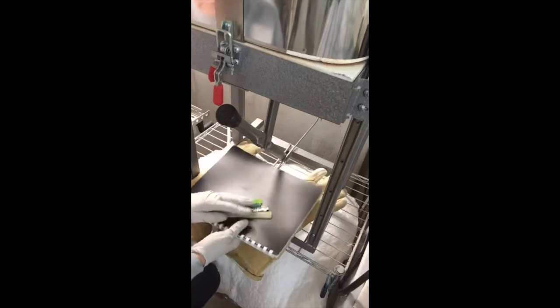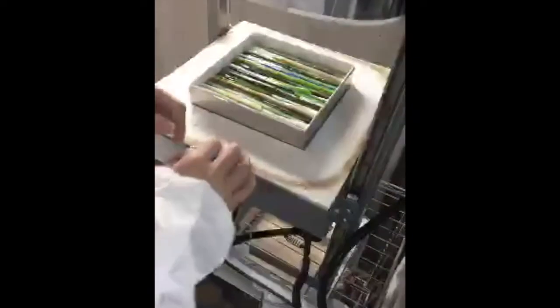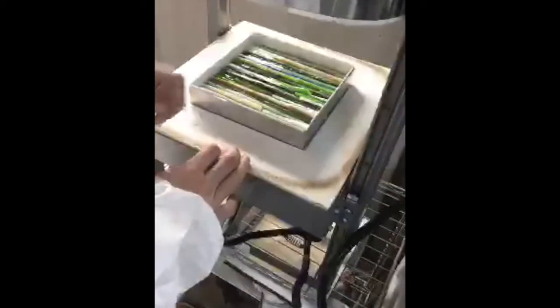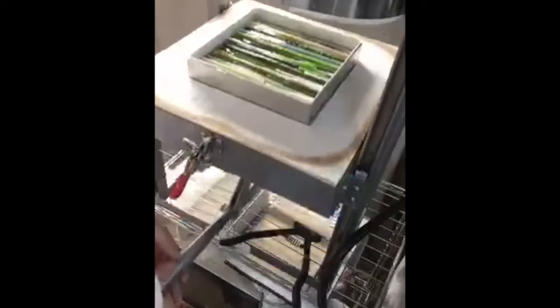What I'm playing with today is my new kiln, the GK1A. These are just strips of glass and I've started the kiln doing 500 degrees an hour up to 1700 degrees. I'm holding it for two hours and that's when I'll comb it, so that should be later on today. I'm closing it up — this is the way this kiln works. You close it up, lock it in, and it's ready to go.